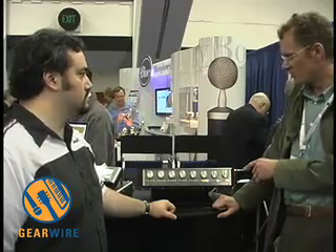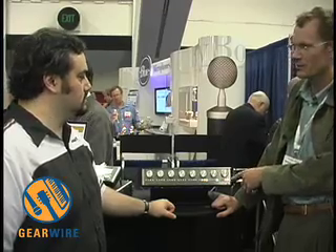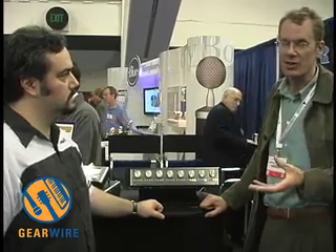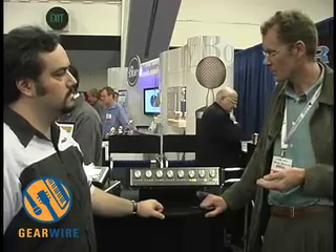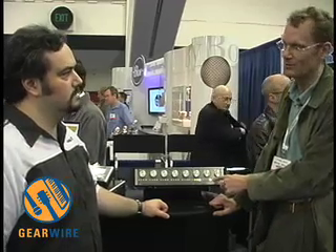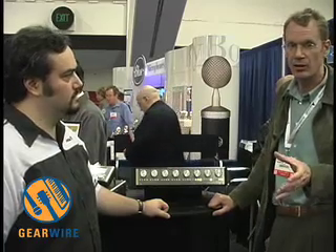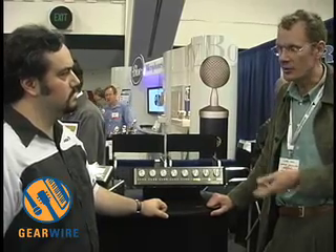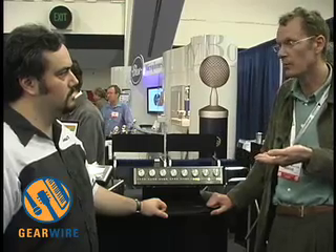The recent additions and features to the M801 compared to its predecessor, the 801: you can see here the ribbon switch. Basically that applies 10 dB of extra gain to the amplifier since most ribbons have a very low output level. It disables the phantom power so you can't accidentally turn on phantom power and blow up your vintage microphone. It bypasses the phantom power coupling capacitors so there's less circuitry in the signal path. And lastly, it raises the input impedance to a high impedance level that ribbon microphones like.